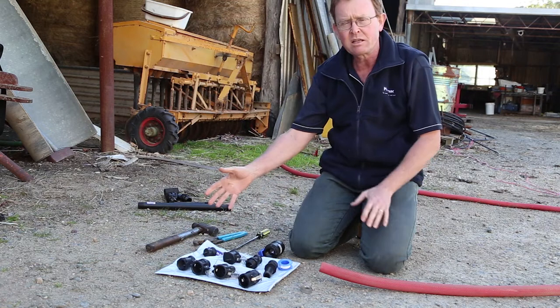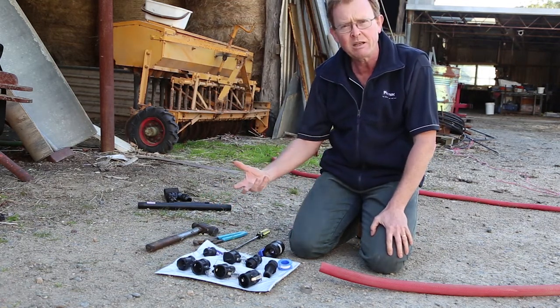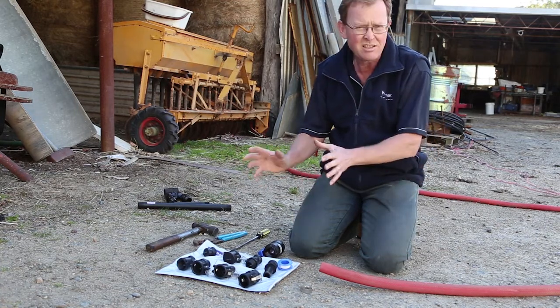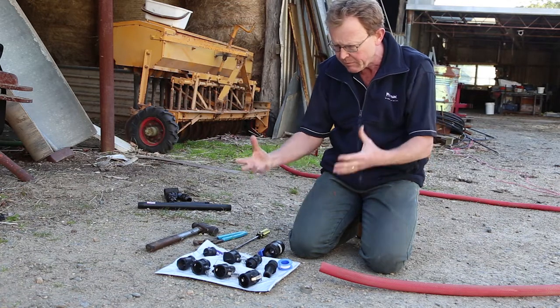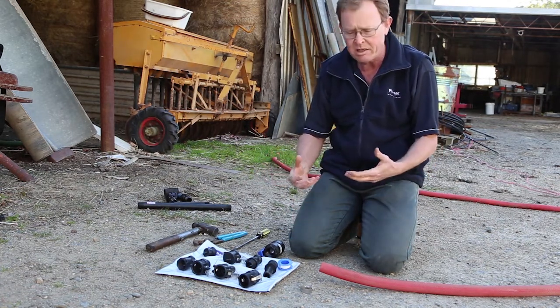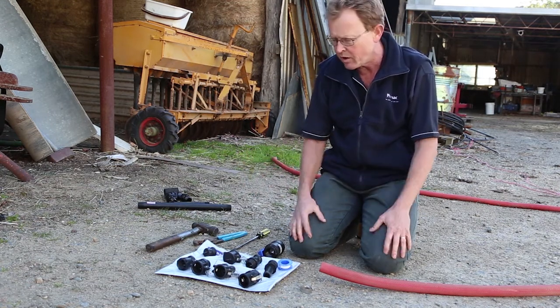This range here is what we call polypropylene — black polypropylene. You can also get them in aluminium and in nylon, which is typically yellow in colour. The application we've got today is to fit them to hose, which is where they're most commonly used. The idea is to fit a hose to a pump and readily disconnect it, or perhaps join two hoses together.